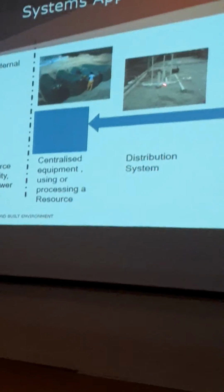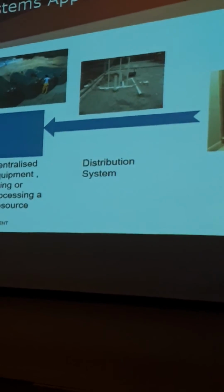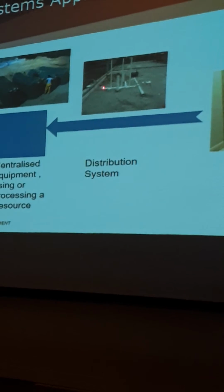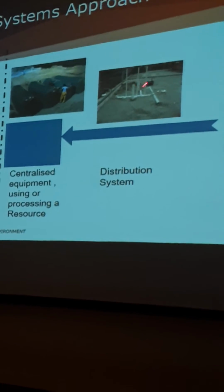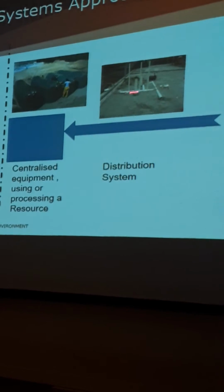Anything, all your waste pipes that need to go under your building, if it's a concrete slab, will go in before the concrete's poured, right? So your plumber gets brought in, and there'll be a waste outlet here, and this will be probably picking up a toilet. And these might be vent pipes, and these might be picking up other fixtures. And they're running through the slab.